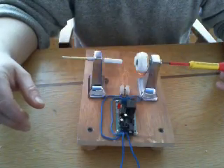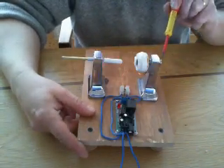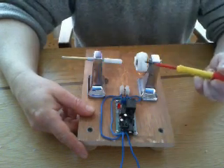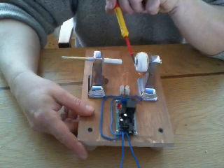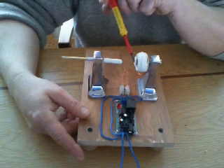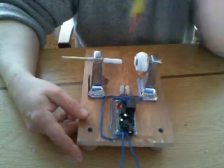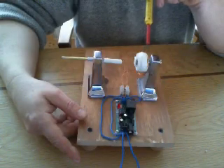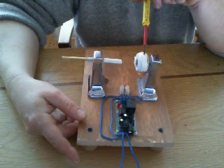On this side, you've got the one-centimeter by two-millimeter stack of disc NEOs, and there's about 15 of them running up there to make Art's base magnet section. That's the coil that he was talking about, and in there there's a 0.8-millimeter soft iron core, which I made from a nail of all things. I sawed the nail down and filed it flat, then stuffed it in a bit of plastic, cut a couple of discs for it, and then wound some 26-gauge enamel wire. I don't know how many turns — I just kept it going until it was really, really thick, and then wrapped it with some white electrician's tape to hold the whole thing together.